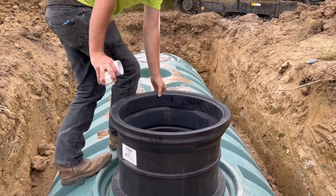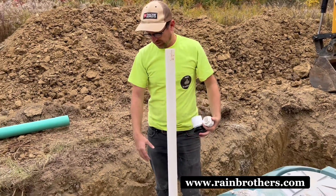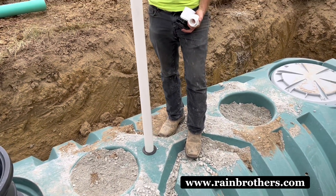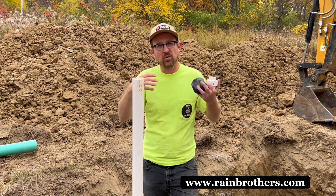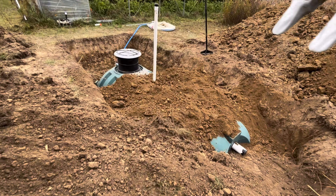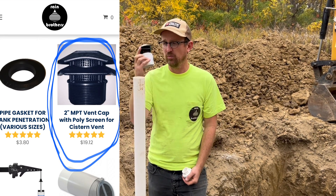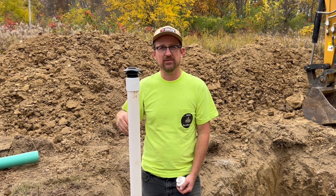Up here, we have a two-inch pipe. This is our vent for the cistern. This is what will allow air to escape the tank as it fills. You want to make sure to have a vent in your system. We barely push this pipe into the tank — it's only in about three inches. The reason for that is we don't want this pipe underneath the maximum fill level of the cistern, because we always want it above the max fill level so that air can escape through the vent. We generally leave it high until we're finished backfilling, and then we'll cut it to just above grade and put in our two-inch tank vent — it's a polyvent, mosquito-proof, available on our website — and that will just thread into a two-inch female adapter, which will then glue into the two-inch pipe to create our vent.